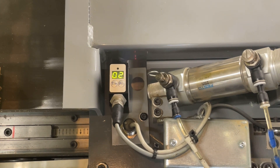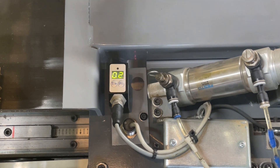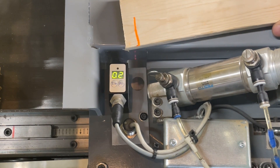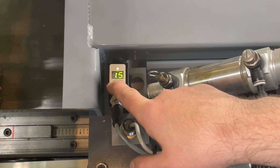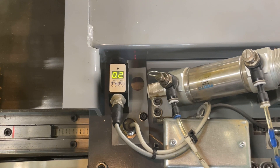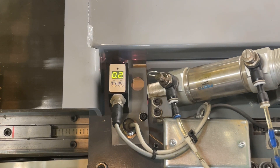Here's the UV crayon sensor — it looks for crayon marks placed on pieces of lumber and detects them with an ultraviolet light, looking for their fluorescence. To set its threshold, hold down the T+ button until the light flashes on top. That LED display will show you a live readout of what the sensor is showing. Then place a board with a crayon mark underneath it — you should be able to see the number jump up significantly when the crayon mark is beneath it.